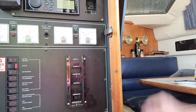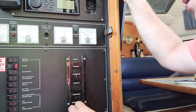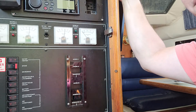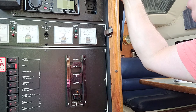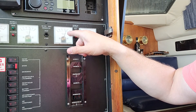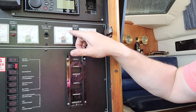I think as I put a load on it we'll see the voltage kind of increase. So let's put a load on it — I'll turn on my AC unit. Hopefully we'll see that stabilize. All right, so now we're stabilizing a little higher, around 110 volts give or take. And if that AC kicks on — now we're at 120.